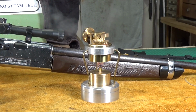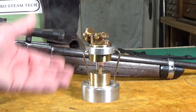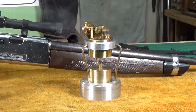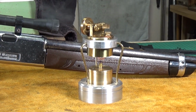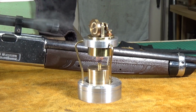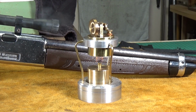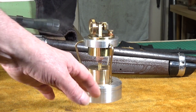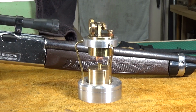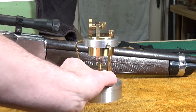It's lovely. It's machined up lovely. There's no inclusions in it or anything. It's just superb. I'm well pleased with that. I definitely think it looks better. Interested to see what your comments are. As I said before, when I did the base, it now runs at a constant speed thanks to the little burner, because obviously the flame height isn't altering, and it's rock steady because of the weight of the aluminium base. The whole engine fits in this ring much better than it did in the plastic one that it came with, so I was able to machine the internal bore out just to fit it.